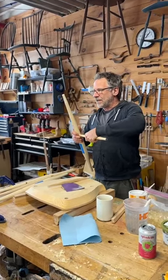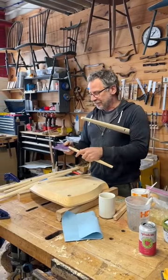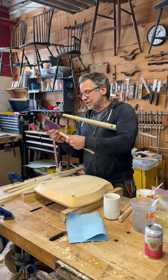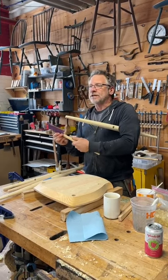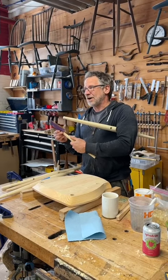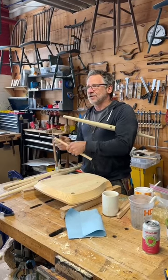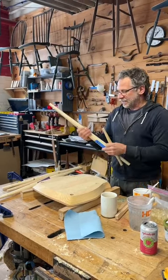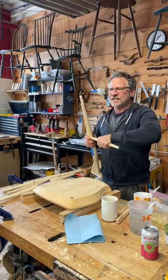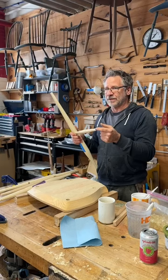So if it won't fit in there, what you want to do is take the sandpaper and sand just the tenon end just a little bit. Don't get distracted while you do this or you'll blow right past a good joint. Don't be talking about other stuff while you're cranking away on this thing — it's a great conversation, and next thing you know this is not a good joint anymore. What we want is to put the joint about halfway in before it really seizes, and then it has to be hammered in. The rest of the joint is a hammer-fit joint.